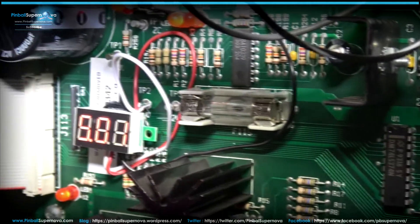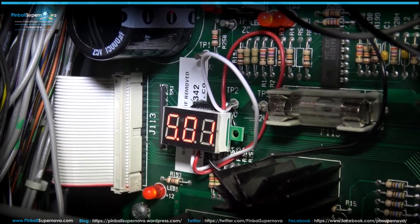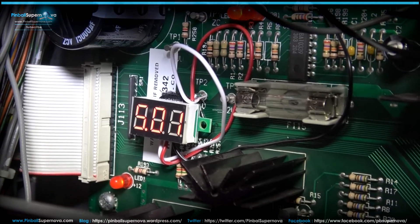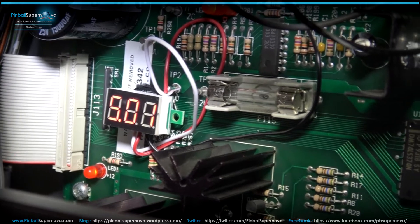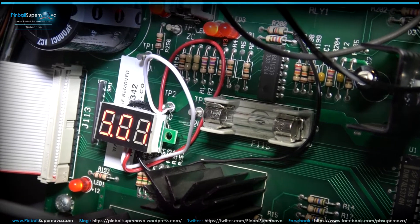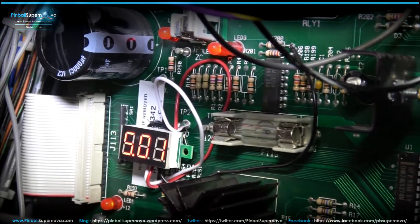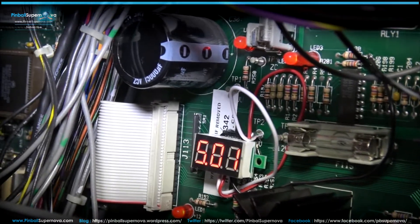It's a cool little readout of your pinball machine showing if the power is dropping or not. It's wired with three wires, but two wires go to one part. And that black wire just goes to resistor R200. The right-hand side of R200 is your negative, your ground. And the power you get off your TP2, next to your 12-volt over there — the little stud that comes out.